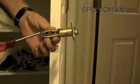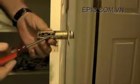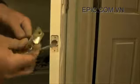And on to door 2. Notice with my screwdriver that I'm pointing to the 2 holes in the latch that the screw posts need to go through. And like door number 1, the first thing to go back in is the latch assembly. Make sure you get the latch assembly pointed in the right direction or the door won't shut. Once I get the screws tightened in the faceplate, then I'm ready to install the doorknob.